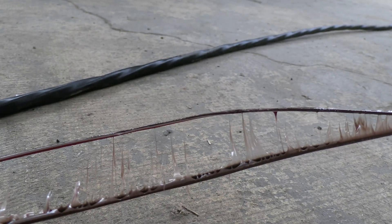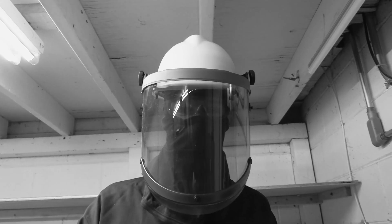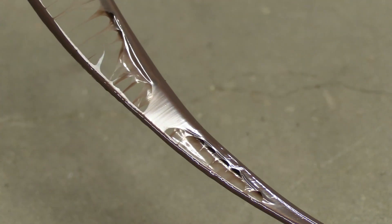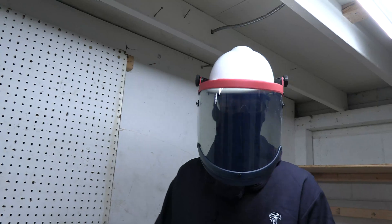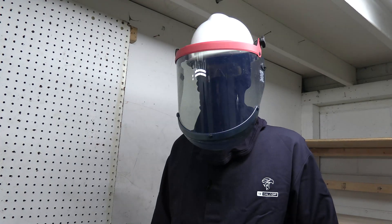The 18 gauge conductor hooked up to a dead short and a 60 amp breaker turned into a thermal event — essentially a 50 foot long heat element. And that was the most impressive sound we've heard today. That is the nature of the thermal event. It literally melted the insulation along the length of the conductor. I want to know what the temperature on that baby was. This insulation is rated up to the boiling point, so effectively the entire conductor far exceeded that instantaneously with that dead short. It took about a half a second to melt, blow, and sever the circuit. And it tripped the 60 amp breaker. I'm impressed.